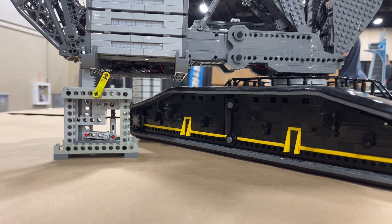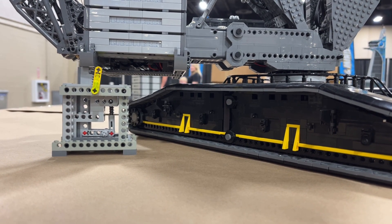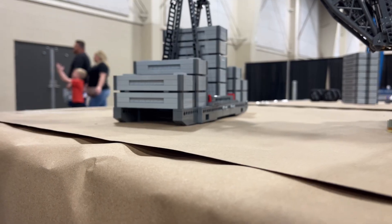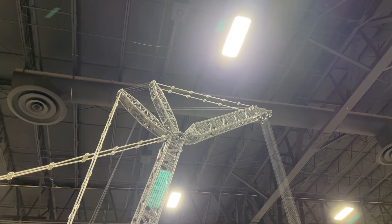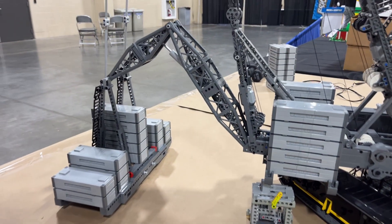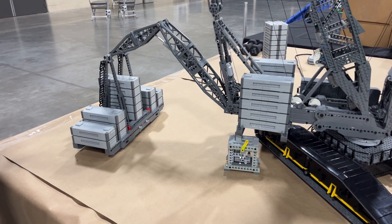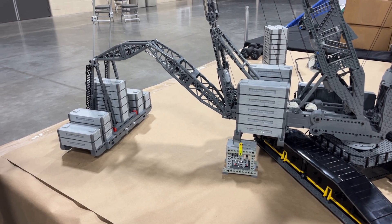You can see that needle moving. Once it gets straight up it's pretty much neutral — just like that. And you can see that now my counterweights are basically on the ground. If I do the opposite and put my boom out — super slow, you've got to really look hard — now you notice the needle. Now I'm going to move my V-frame right back here; as I move it out, that needle is going to change back.